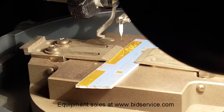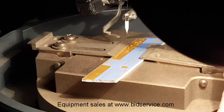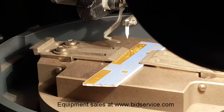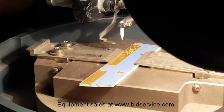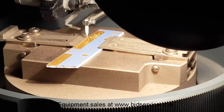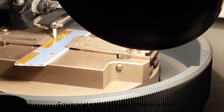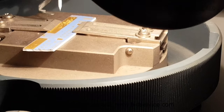So what I'll do is open the clamps, pull the wire up like so, close the clamps, and readjust the tail size to three. This is what you call a bond-off. I'll bond it off and now we've created a ball that way.